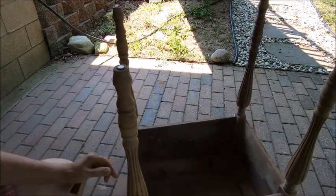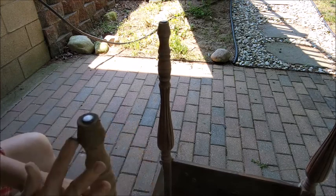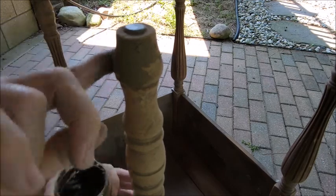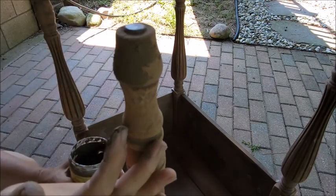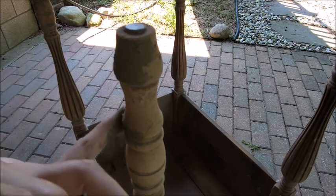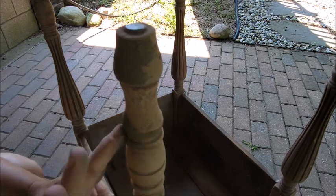The bottom of the legs were pretty rough as well. Once I sanded them down I really started to see where all the damage was. It needed a lot of Dixie Belle mud — the brown — and I had to just apply it with my finger and go right around in a circle, trying to rub that in. These were so damaged — you could see basically a lot of the wood grain was up, so just trying to even that wood grain out and also fill any really deep gouges. It sanded very nicely. I used my rad pad so you can basically go right around that spindle and it will knock down any of the high spots on the mud, helping the paint look nice and flawless when we get to that point.